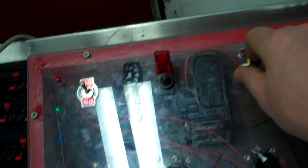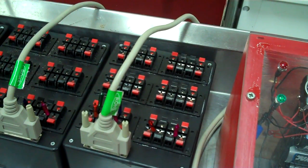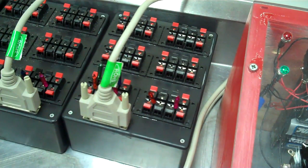I'm going to turn the system off. If you notice the instructions — this is a really important thing — the instructions on the website leave out the part that every cue has to have a diode on it. So what I'm going to do is open up one of the slat boxes and show you the inside, because you have to have a diode for each cue. Where this system uses a common ground, for the whole system not to short out, you have to have a diode on each cue. For this system you'll need 144 diodes — they're only about 30 cents a piece, so it's not really expensive, just time-consuming soldering them in.